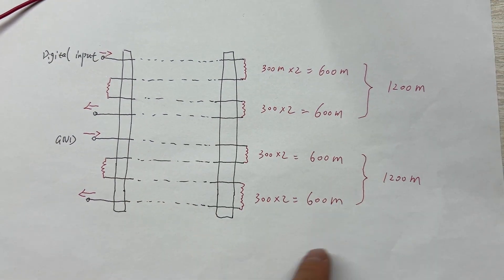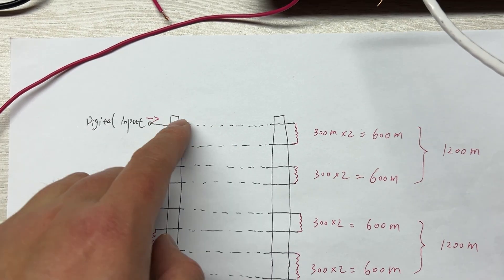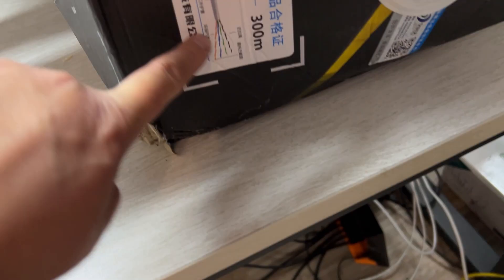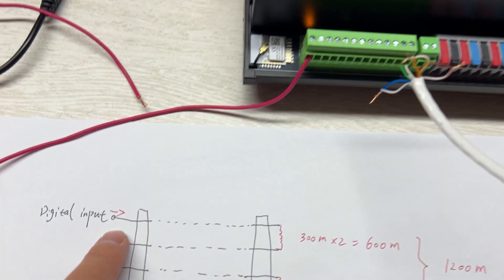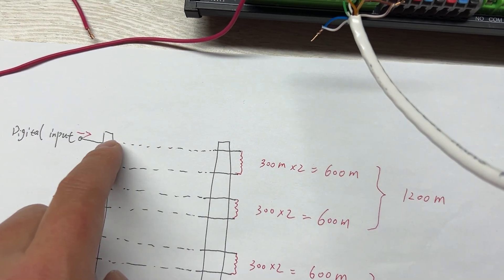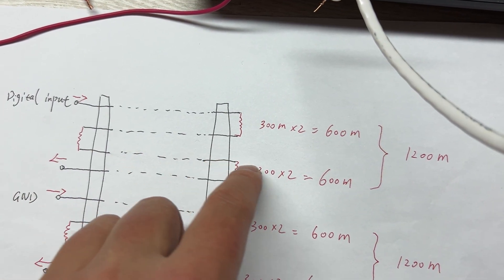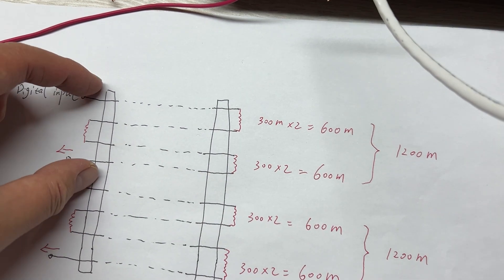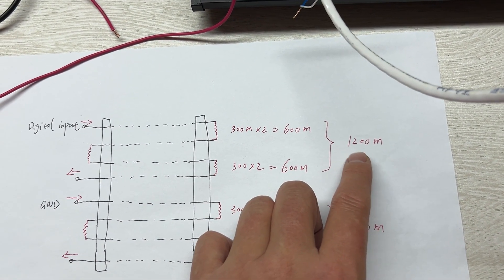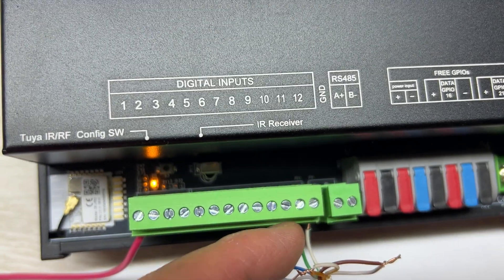Now I have connected by this way - because the total has 8 wires but I have shorted the full one. Every one direction is 300 meters because this cable is 300 meters. So twice is 600 meters - go this direction and back. So this one is 300 meters twice, so 600 meters - go to this direction and back to this direction, that also 600 meters. So the total is 1200 meters. Because we stated max 1000 meters, actually we have tested with 1200 meters, also no problem.